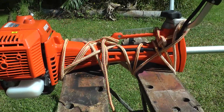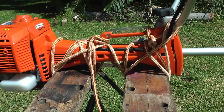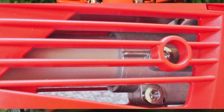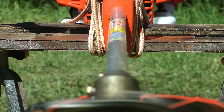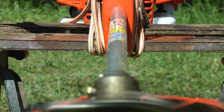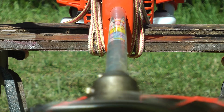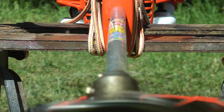Here I have tied an Echo brush cutter to a table by the anti-vibration mounting system. I wanted to demonstrate how bolting an engine directly to the shaft allows more engine vibration to travel up and down that shaft. These vibrations then interact with each other, resulting in rogue waves that are strong enough to cause noticeable bending of the shaft that I've never before seen in rubber-mounted engines in all the brush cutters that I have owned.